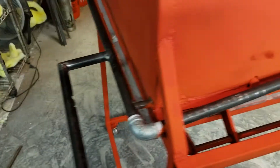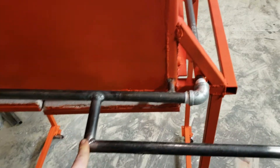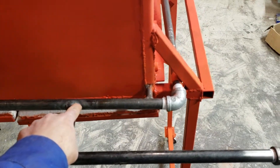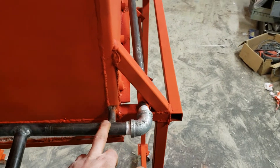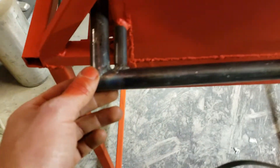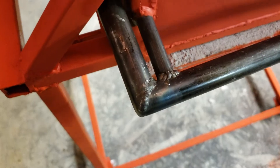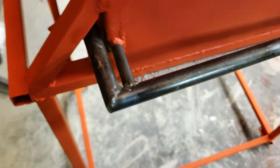There's the pipework. Heated it, bent it, TIG welded these on here, put little struts here to just sort of connect them. I pressure tested these so they actually, even though they're not beautiful, they actually do hold gas, so that looks pretty nice.